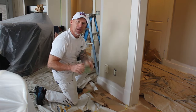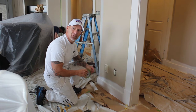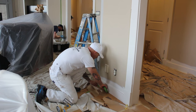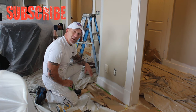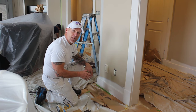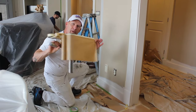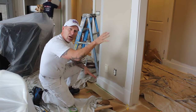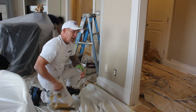Masking these hardwood floors and getting ready to spray — we just take frog tape (we did have some yellow frog tape for delicate surfaces, but we typically use green frog tape) and run it along the hardwood floor just like this. You want to get extremely tight to your baseboard so you don't get any overspray on the hardwood floor — this is the most critical step when painting trim on a hardwood floor. Then once that tape is down, we go back over it with nine inch paper and one inch 20-point tape, going right over the top.